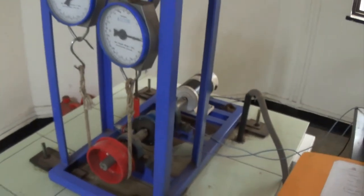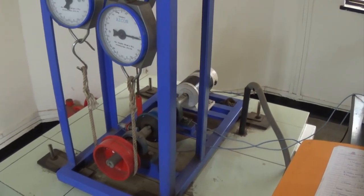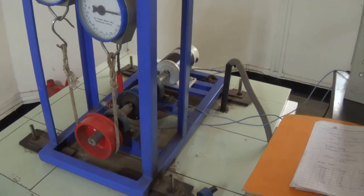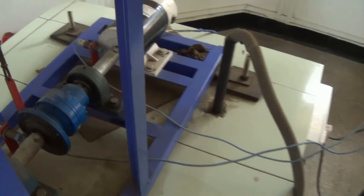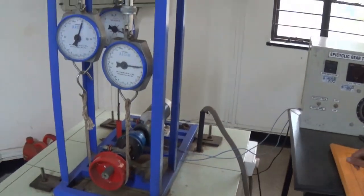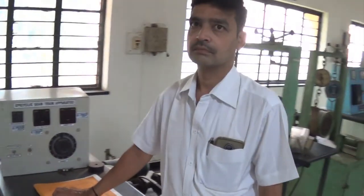The Ampere at that time was 1.55. This comes into the picture when we are doing the calculations. We can see that the theoretical values are matching the actual values. Therefore, from my side, I can conclude that using this particular instrument, practically we can find out the holding torque. When you want to find out the holding torque of any epicyclic gear train, we bring that gear train here, replace it with this epicyclic gear train, and using this particular setup we can find out the holding torque. That's all for this particular experiment. Thank you for watching.